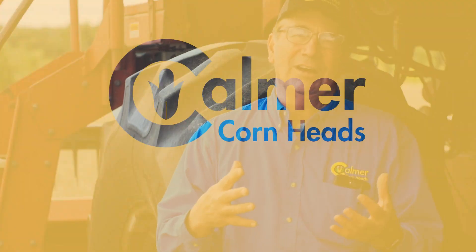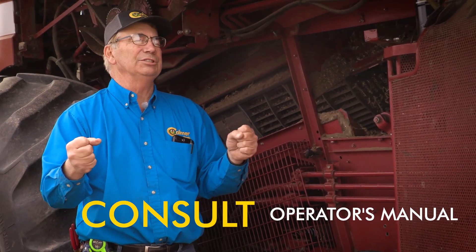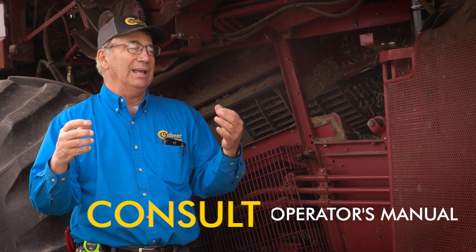I always encourage farmers when they call in to do a kill stop. On this older machine, I just reach over and grab the throttle and we're coming to what's called a rolling kill stop — everything stops at the same time: motor, rotor, sickle, reel, the whole thing. On some of the newer combines it's a little more difficult. I would suggest you throttle down, then click the toggle switches, pull back on the hydro, and let the motor idle for a little bit to cool off.